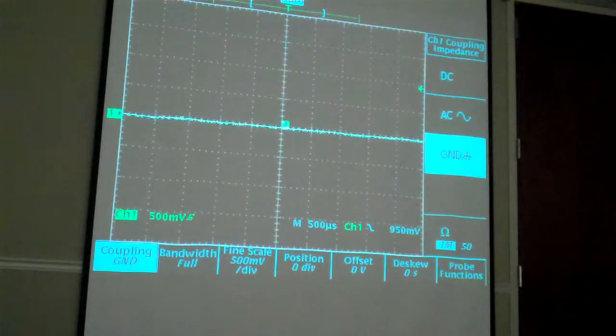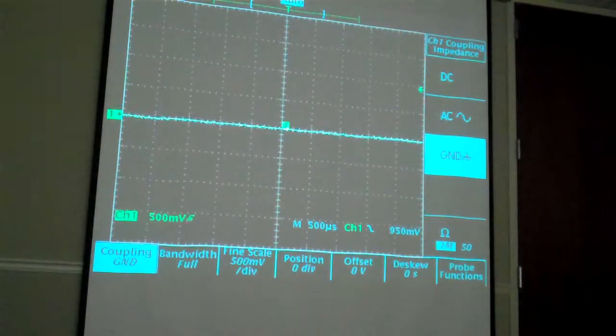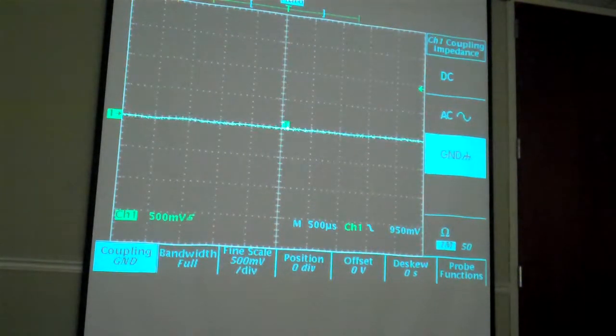It's more the electrical engineering aspect of trying to remove the DC component of the signal so that you can more clearly see the part that is moving. Basically, you're removing the part of the signal that's not moving, so you can look at the part that is moving, and by removing that DC component, you center it. You will always have the trace centered about 0 volts.